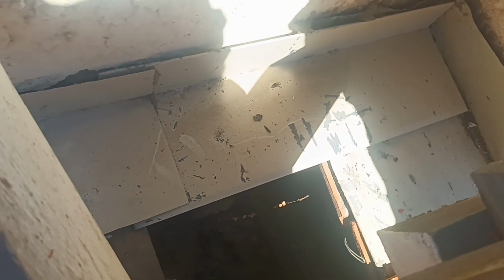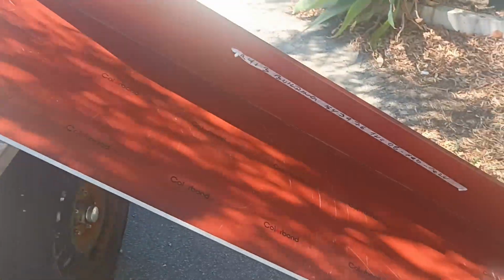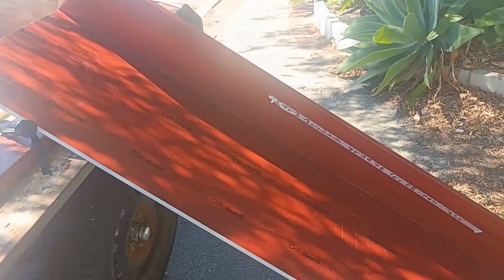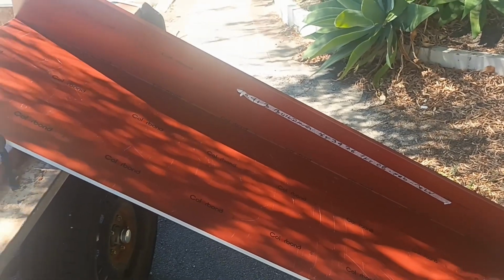So what we're going to do with the lead keeps the water above the tiles. I'll show you it at the end. It doesn't let it get below them, so it won't drip into the roof. Any water that comes off it will come back onto the tiles and run away. A new piece of flashing, it's bigger than obviously the old one. I've made it quite a bit bigger because I can always cut it back, and also that way I know it won't leak.